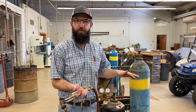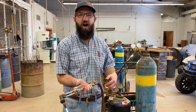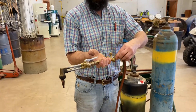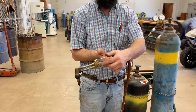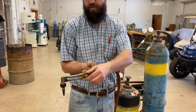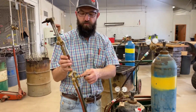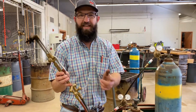That's the end of the startup process. Now to shut it down I'm going to go in reverse order. I'm going to turn off the fuel first on the torch — that makes the fire go away quickly. I still have oxygen coming out through the upper mixing knob, so I'm going to turn that off. I'm leaving the torch handle oxygen knob on — that's to bleed it out later.